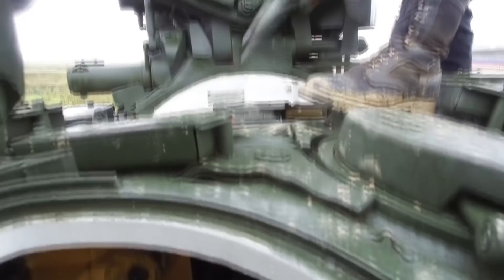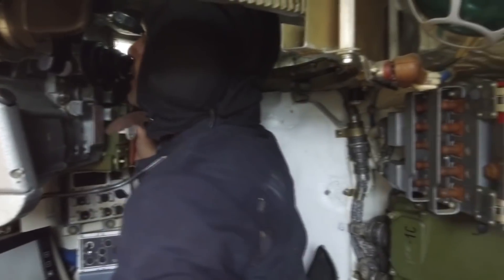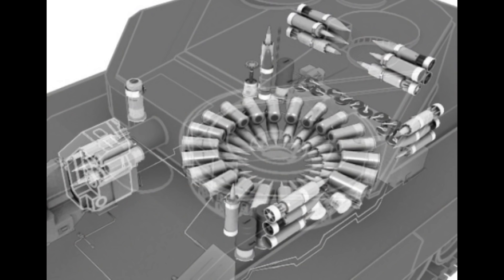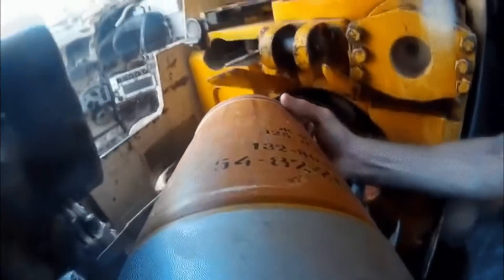The completely manual procedure is much more rare. The tank is loaded manually mostly only if the autoloader is physically damaged and rotation of the parts is impossible. In that case, the gun is brought into the loading position and the commander grabs one of the ammo pieces from the tank's internal storage — the desired projectile — pushes it all the way in with the ram, then grabs the charge and does the same until the breech is closed. It sounds simpler, but it's much harder to go around the tank picking up pieces of ammunition than to turn handles.